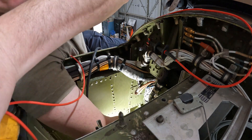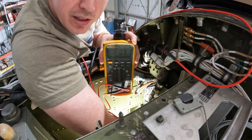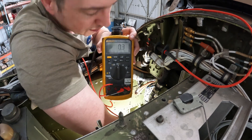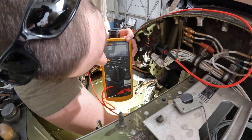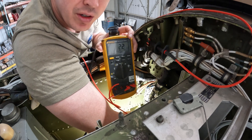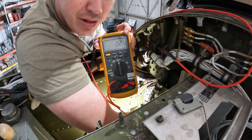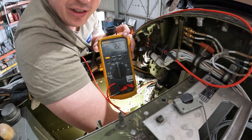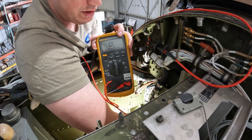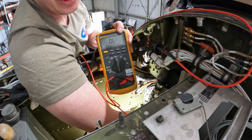So now I'll show you guys what we got. This is the side hooked to ground — you can see it's a very low resistance path. Now if we go to the other side, we get 2.2 ohms to ground. So electrically it's testing fine — the actual coil that powers the electromagnet that should be pulling the contacts together is electrically fine. Whether it's mechanically good is another story, and we've got to check for that next.